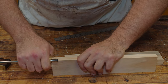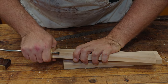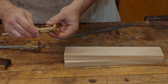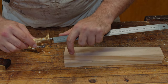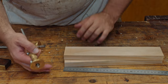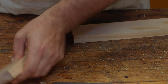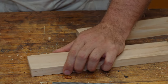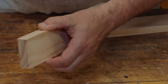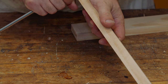You can see it really doesn't take long to quickly wrap a marking gauge line on the edges of these for a rebate. Now we're going to get our depth of this rebate, which is 6mm — rule it straight up there, lock that down, and that's pretty quick and easy. You can just keep it down like this, or if you find it easier to reference you can do it like this, but that's going to be harder to see — that's why I tend to hold it up.